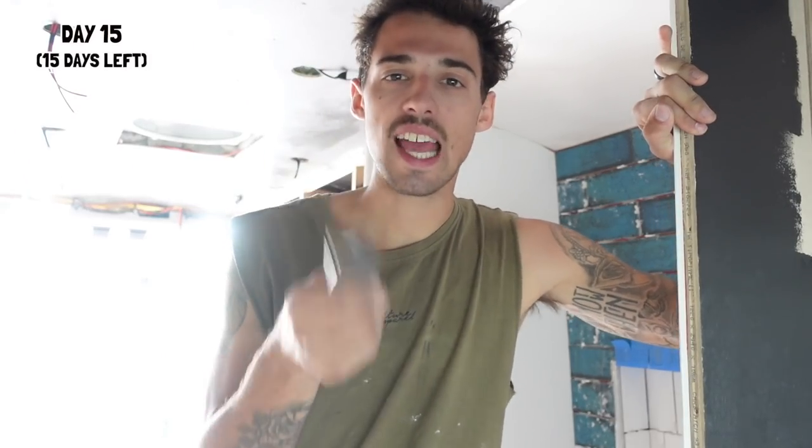Morning! Today is day 15, which marks exactly halfway through the 30-day projected build. First order of business is clean off this tile, all the excess silicone, and then grout it. We opted for silicone this time instead of normal tile mortar, just because we've seen it done by so many people and figured it works. Why waste all that time putting up cement board — which is extra weight — having to mix mortar? The silicone application was super simple, but it's a little bit harder to clean.